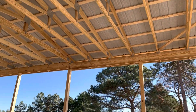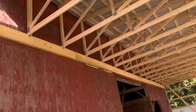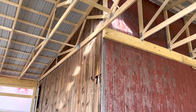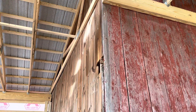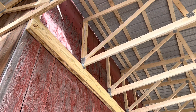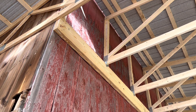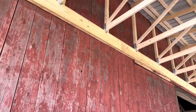You see the top header that we use — we actually utilize yellow pine 2 by 12 on this. Check out how we attach that: you can see the truss there. We also ran a double 2 by 12 top beam header up there. We ran 2 by 4s to connect the trusses and set everything in place.